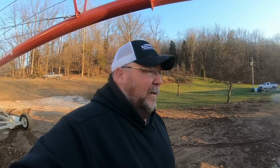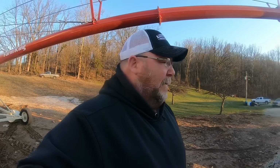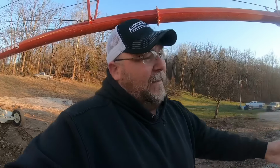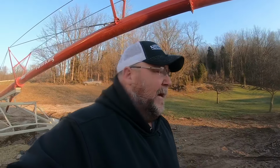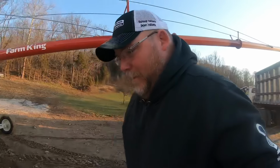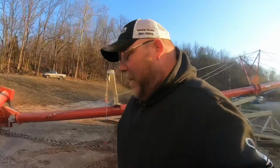We thought the triaxle would be a little more stable for dumping in the field, so that's why we're running it for now. If we want to, we can always modify it and cut this front axle off to make it just a tandem and lighten it up some, if we don't think the triaxle is doing what we needed. But you definitely do not fill this trailer full of corn, or somebody's not gonna like you. Like I said, for hauling turkey manure, you can round it up.